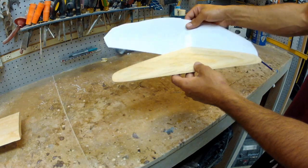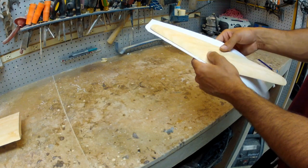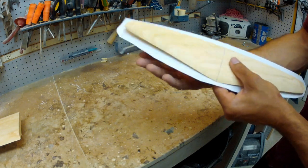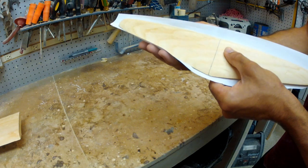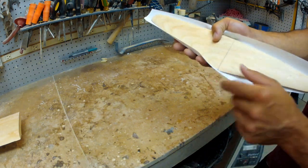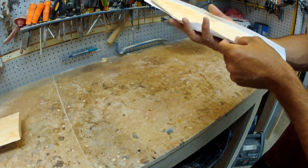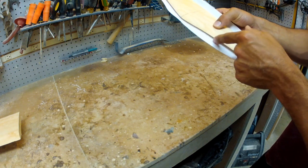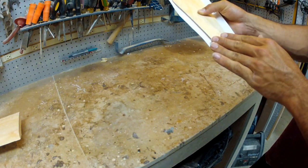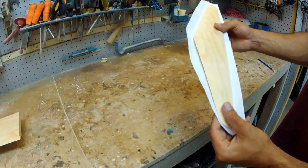You do the second side just as before — put your piece, wet it out, and let it cure. A little trick I've learned: once you've already done this side and glassed the back side, the glass is going to be drooping and cured. Take extra epoxy or polyester resin — whatever you're using — and just dribble a line along the seam going all the way around. Let that harden. That gives you a nice edge to connect the two sides, and you'll have about one or two millimeters of cured resin. You can then use those one or two millimeters to shape your edge with sandpaper going all around the part. That's an easy way to hand lay up these parts — you can use a vacuum if you want, but it's definitely not needed.